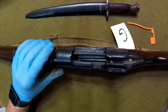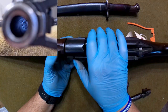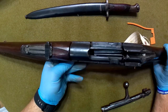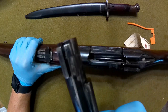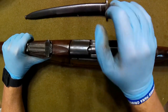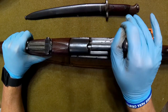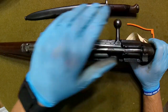There might be some rust — I'll have to take some time to do another video to get this thing out of the stock and take a good look at it. I do need to take a look at the bore off camera. Guys, it is a super mirror bright bore — you'll see the picture up here — with excellent looking rifling in it. I would have no qualms about taking this thing out and shooting it. I forgot to say the bolt head is also matched with a 44. The extractor claws look good in there. I see why people say these are very smooth — they are extremely smooth. That is a very smooth bolt.